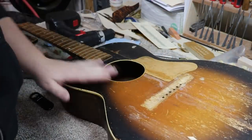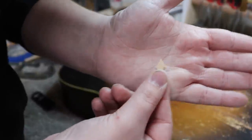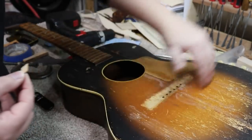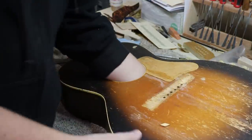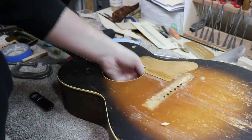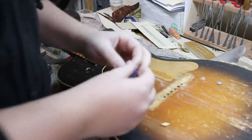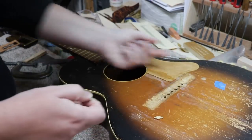I've been working on superglue and some of these cracks are closed. Before I move on to working on the back a lot, I figured I was going to cleat some of these top ones. I've made some spruce cleats out of a nice piece of spruce. I'm going to put them in here with the grain perpendicular to the grain of the top. There's a couple of spots behind the bridge plate where it could definitely use some cleats - there's a big open spot on these cracks. I'm going to use magnets to stick those in. The best way is to tape a magnet to the top so it can't move, then put a magnet on the back of the cleat when it's got glue and it'll go right where I need it.